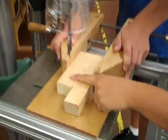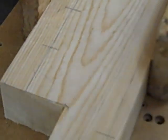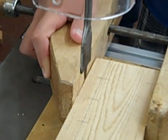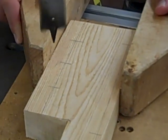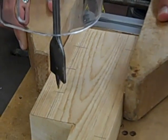Now we're going to drill the window holes. As you can see, we have them marked and we have a one-inch spade bit — that's bigger than what you should be using, so refer to the packet. Your guard should always be down, and make sure that your bit is tight. We lined up our drill with the stopper and the table so that the end of the bit will barely go through the wood.